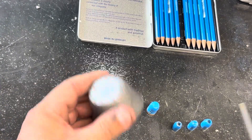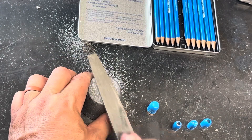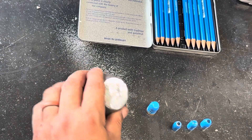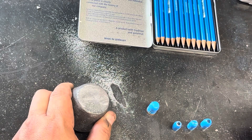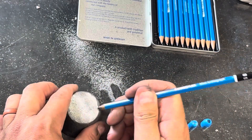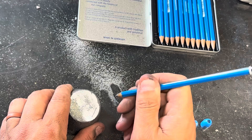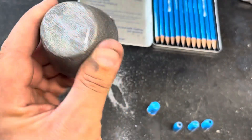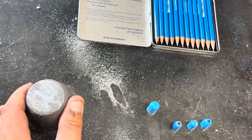So I take my other example here and do the same thing — just get a nice smooth surface on it. A lot of people will say that you can quench wheel weights and get them up into the 20s; I haven't tried any to see. I'm more interested right now in messing with the alloys, just seeing what I can get up to. So we're going to start with the 6B, which would be the equivalent of a 4 to 5. And you can see I scratched it already — so this is super soft. This is not clip-on wheel weights, this is just soft lead. So I'd have to add a lot more pewter to this to get hard cast than I would the clip-on wheel weight lead.